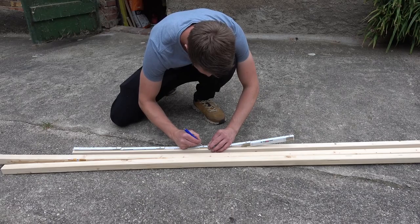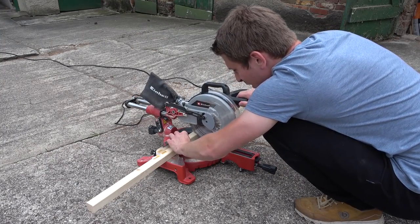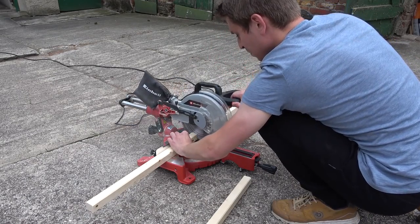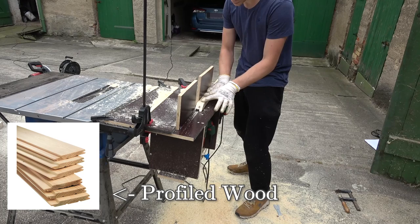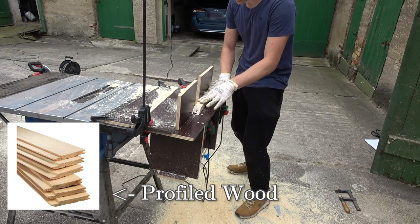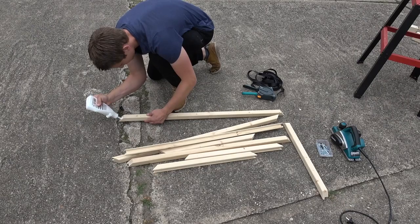Now for the wood. I first cut out the window frames from spruce stock using my miter saw, mitering all ends in the process too. The profiled wood that we use for the walls will sit in grooves at all times, so to embed the frames into the housing, I used my router table to cut the grooves before gluing everything together.